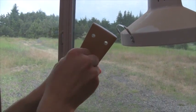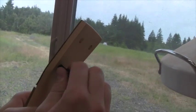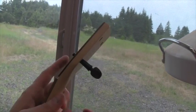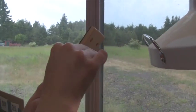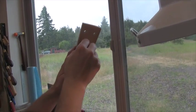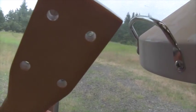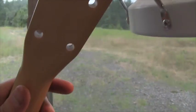Try it again. Now by hand I can get it until the threads pretty much disappear — that's what I want. Now by backing it out, what I'm doing is tapping that hole so that it's threaded inside. And if you could see up close to the camera, there's now little threads in there, like a nut and a bolt.